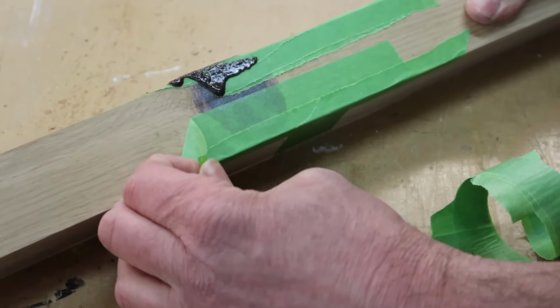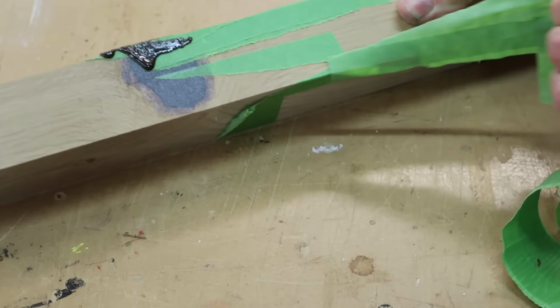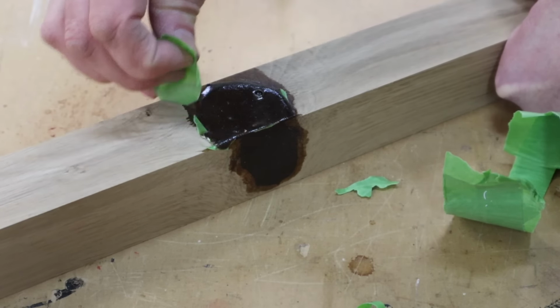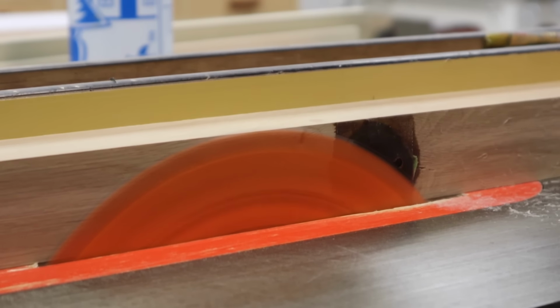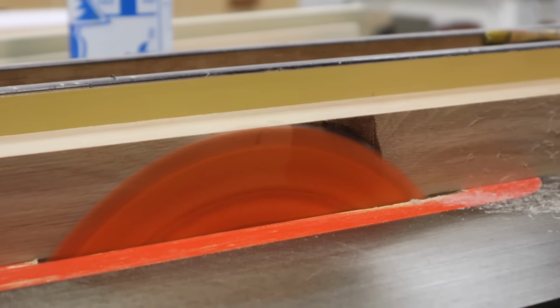The sawdust is from my belt sander. It's a very fine sawdust. And I'll make a vessel using the painter's tape, fill the knot hole, let it dry overnight, and then shape it, in this case, using the table saw and a little sandpaper.